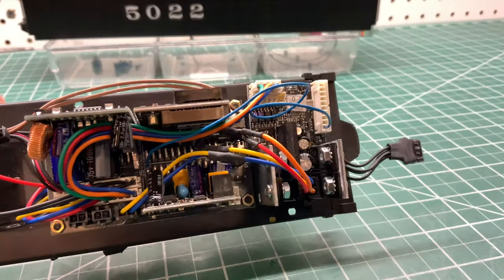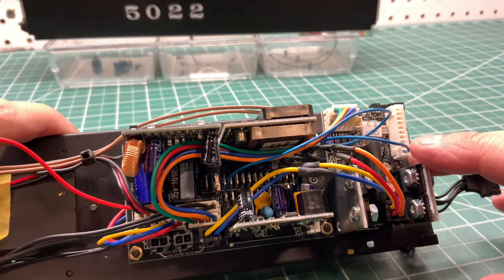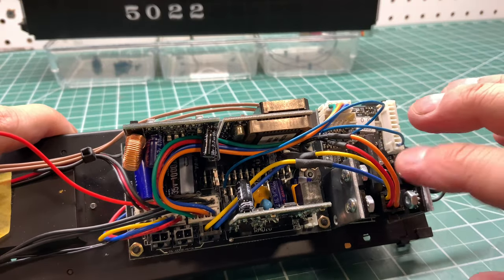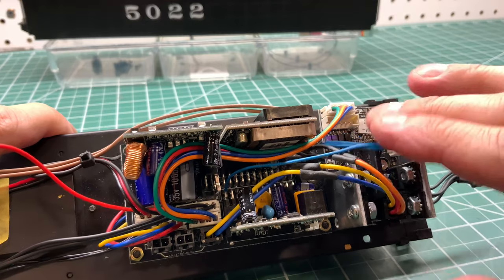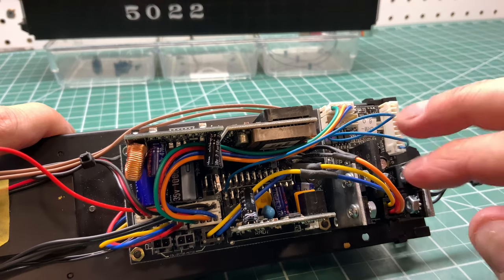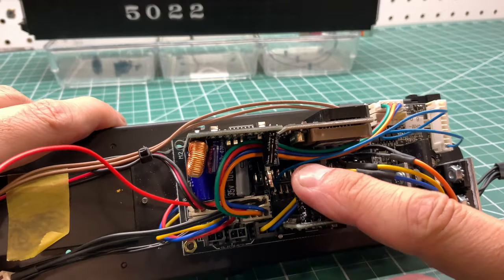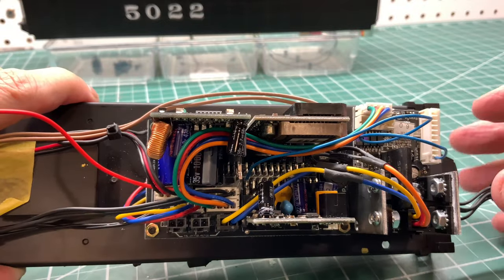I just wanted to make a couple notes on this Cruise M installation. Much like the DCDR, you've got to provide AC track power to it. It's got the motor leads heading out, and it still uses the PWM from the R2LC, but you also need to provide the serial comm off the R2LC. And that's done here on pin 24. You can see I soldered it down there.